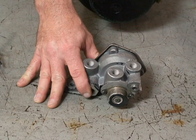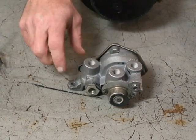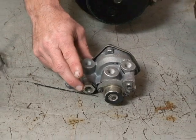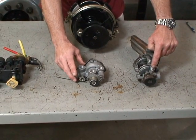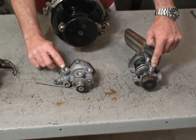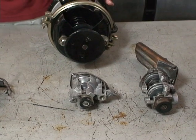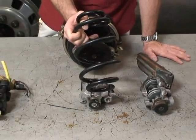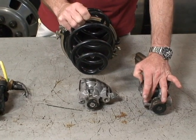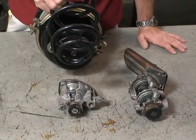When you lose the air to your rear brakes or primary circuit, this valve senses that there's no air pressure in your primary tank. Because we have a connection to the secondary delivery port in the treadle valve for your front brakes, we use our front brake air pressure in the event that we lose our primary circuit, to release air through the exhaust port of this valve, to allow about maybe five emergency brake applications using the spring brake or parking brake. It releases air out of the parking brake via the secondary treadle valve to the SR-1 Spring Brake valve, and it uses the energy in the spring to give us some emergency brake applications.